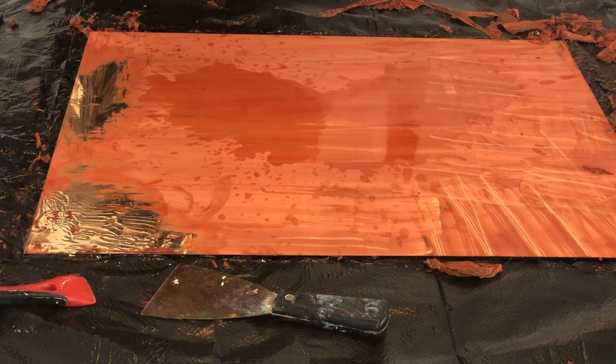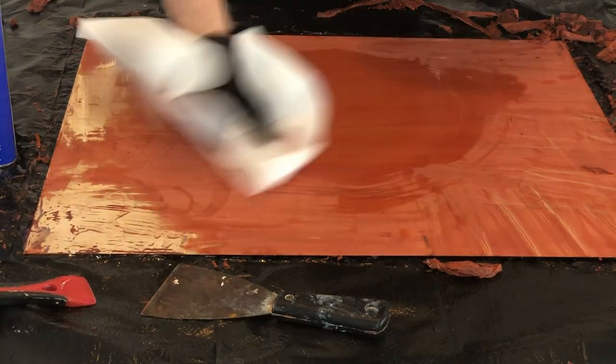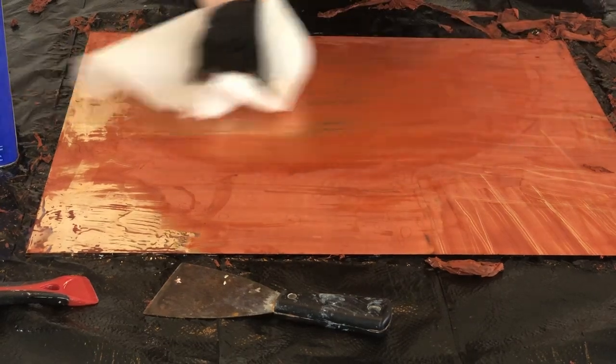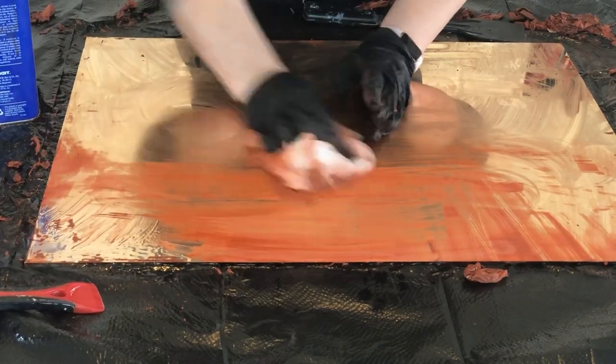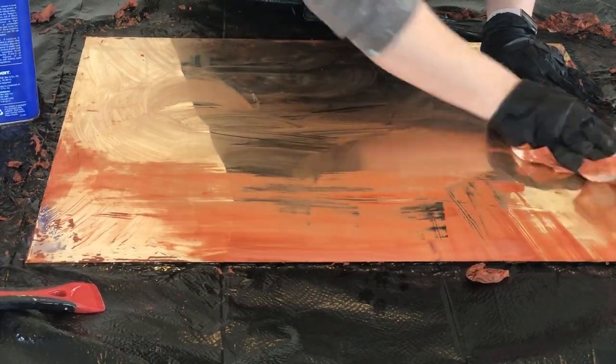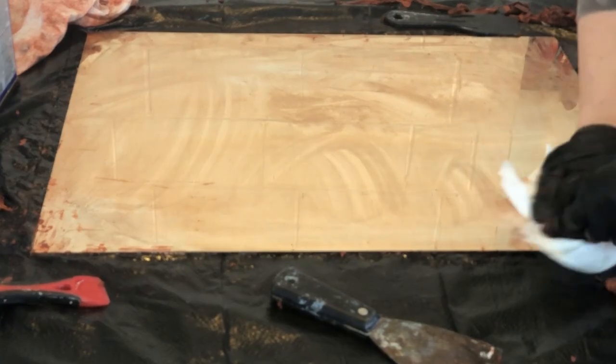Next comes the after wash. I tested it on a small spot and it didn't remove the golden reflective surface. After you've removed the paint from the back of the mirror and it's ready for the next step, your mirror should have this light golden color.